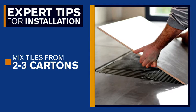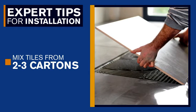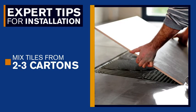There are many patterns you can use when laying a tile floor. Because we're using 12 by 24 tiles today, we're going to stagger the tiles with what some guys might call a brick lay pattern. It's a good idea too to pull tiles from several different cartons as you install. This will improve the overall appearance in case there are slight variations in color.